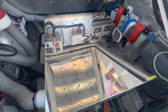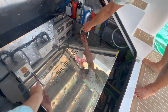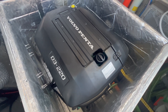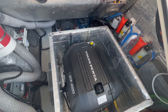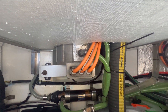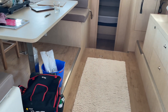The generator is covered by a nice shiny cover as well as a sound shield to make this silent yacht worth its name. It's a Volvo Penta D3 220 unit with an output of 150 kilowatts. So both the solar array with the Victron units and the generator are made for one thing: charging the batteries.